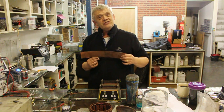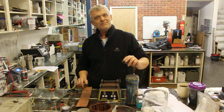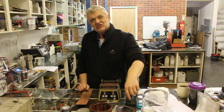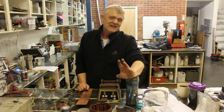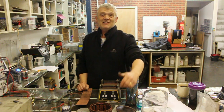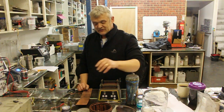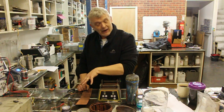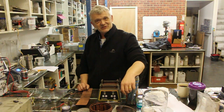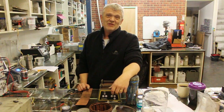But at the moment, it gives a nice shiny bright copper coat that resists the tape test. So that's a really simple, easy way to copper plate aluminium. My next one is to try a little bit of stainless steel and we'll see what happens. The benefit of this system is there is no waste — the copper nanoparticles get bashed on there, and when the nanoparticles are reduced, you just put more nanoparticles in. So there's no waste stream produced either. I thought that was of interest and I thought I'd share it with you.